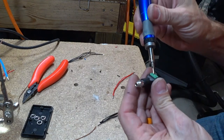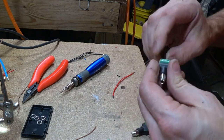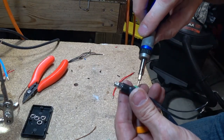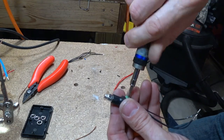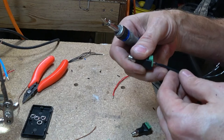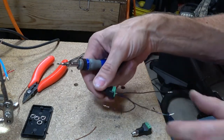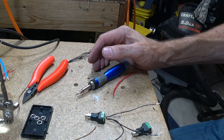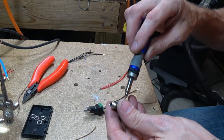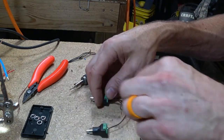I took three black wires, tinned the ends, and soldered them together. Let's say this one is going to be the cable going to the Cardo PacTalk. I stick them in here and tighten the screws on the outside, which holds the wire inside the terminal. This is the sleeve connection — one of these goes to the connector beside it, and the others go through to the remaining two connectors, so all four connectors are grounded through the same shield. This side here is going to be for the Cardo PacTalk speakers.